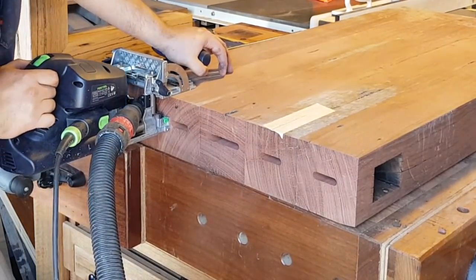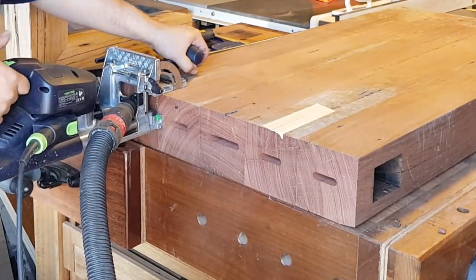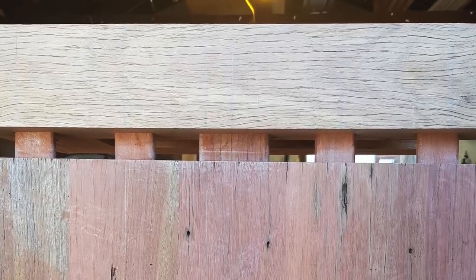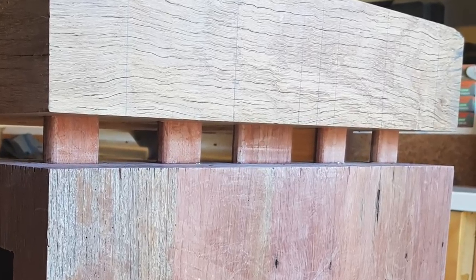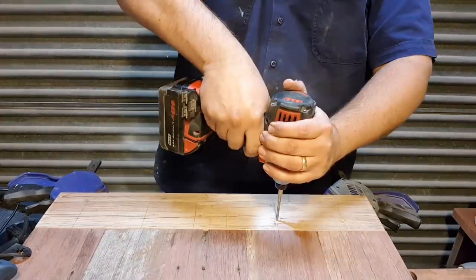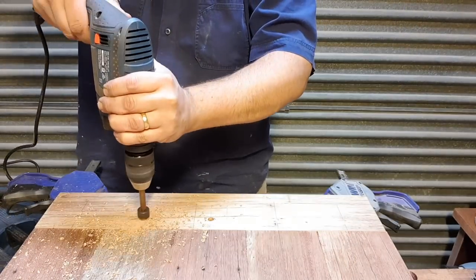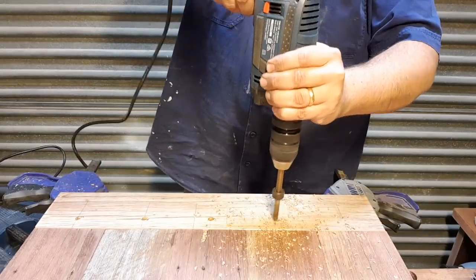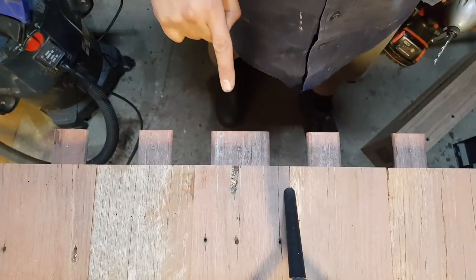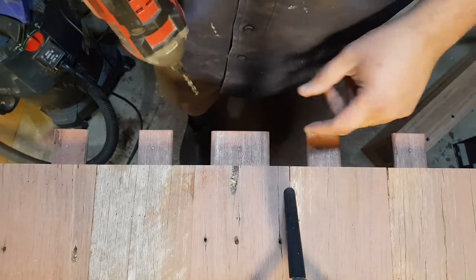You've just got to be accurate — if you're careless and not accurate, like I was here, you'll have a problem. Now I'm marking for my dowel holes, one inch from the edge, getting the hole started with a smaller bit and then going in. That's got a depth stop set to just make a mark on the tenon without going into it. I'm going to move my holes in by about half a millimeter — that's going to pull the joint tight when I slam the dowels in. It's called draw boring.